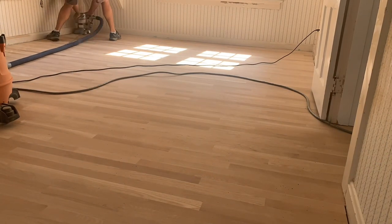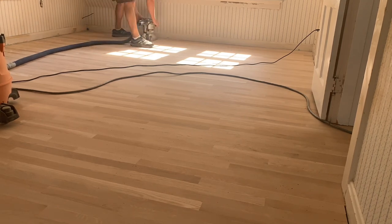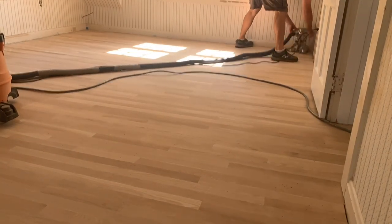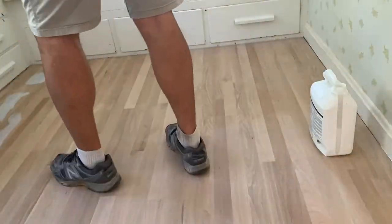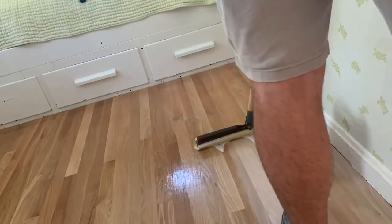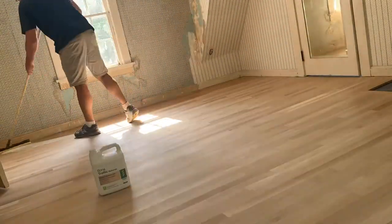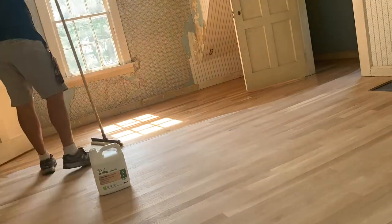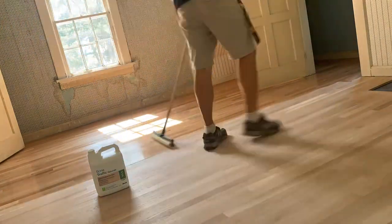Here you see me in the upstairs of the house — it's rinse and repeat, the same process. We start off with the 40 grit paper going over the entire floor. Once the entire floor has been hit, switch out the paper, go to 80, and go over the entire floor again. At that point I pull the corners, then buff and vacuum. This customer chose to seal the floor with a water-based polyurethane — a two-part catalyzed finish made by Bona called Natural, which is known for keeping the floors as light as possible.